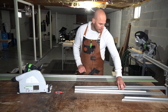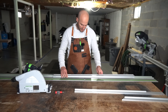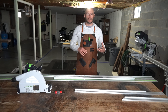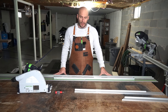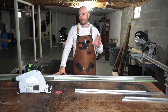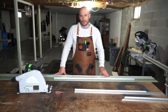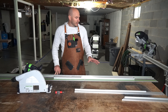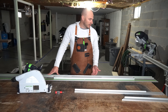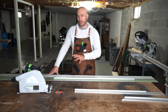The next thing we're going to do is take our straight edge — I'm using the telescoping attachment from the Festool trimming attachments. I've seen people reference the outside edges of the guide rails to check alignment, but depending on the condition of your guide rails, that could give you bad results, because people can mishandle or accidentally drop these guide rails and those edges can throw your alignment off.